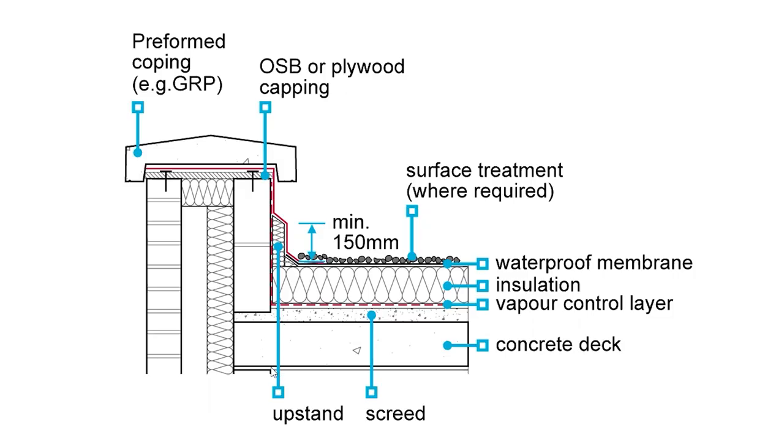Supposing this bit was masonry going down and we just got the joist let into the masonry, you would have a transfer of cold from that parapet wall down into the lower bit of brickwork. So you would get a little bit of cold bridging along there, and you would get a line of condensation appearing just there because of the transfer through there.